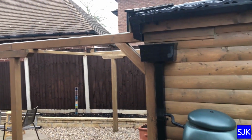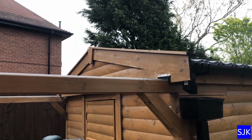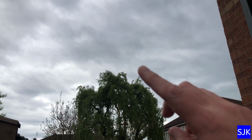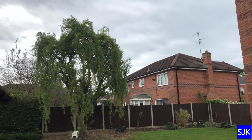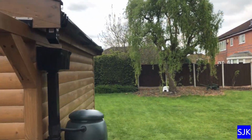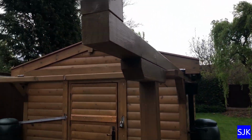So that's my observatory. The roll-off is to the north, which is the way that most observatories are built. The roof rolls off to the north, because most planets, constellations, or anything for that matter in the sky, is going to be at its highest across to the south, when it crosses that meridian line that I spoke about. So always, if at all possible, try to build your observatory so it faces towards the south, and the roof rolls off to the north.